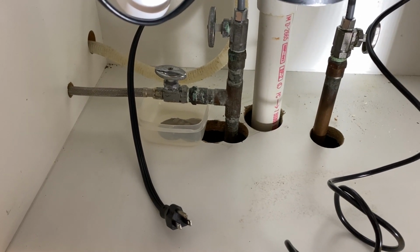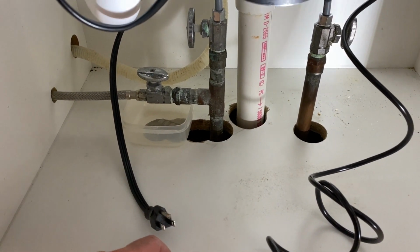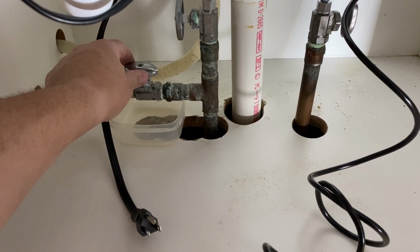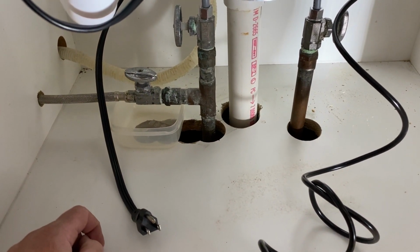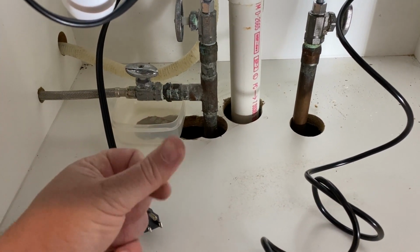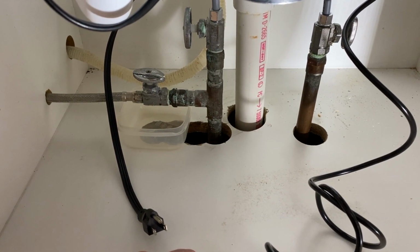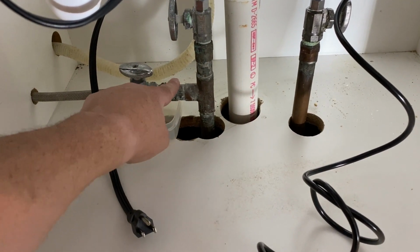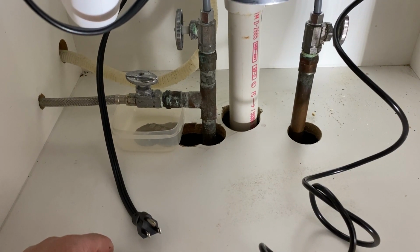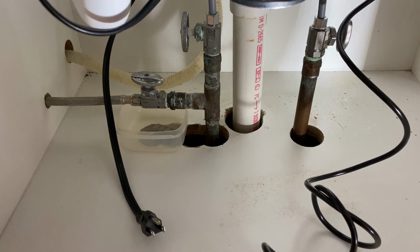But as I'm telling you this, I'm watching this drip slowly here. It's aggravating the crap out of me. So this valve right here is just going to need to be replaced. These valves are kind of garbage. They're just dumb plastic valves, and because I have hard water from my well, you get a lot of this, they call it efflorescence. You know, it's lime deposits, calcium deposits. They call it efflorescence on brick. I don't know if they call it that on pipes.